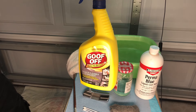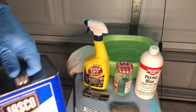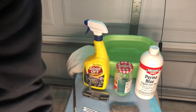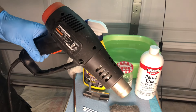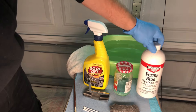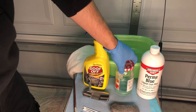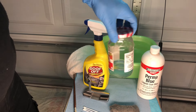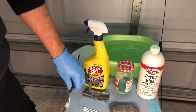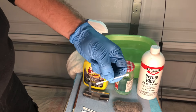All right, so you're going to need a degreaser to take off any oils, fingerprints, etc. Another thing that will help is some acetone. You're going to need a heat gun — I like to heat up the part so the gunmetal will actually burn into the surface. You'll also need Birchwood Casey Perma Blue gunmetal liquid, a little jar to keep the liquid separated so you don't contaminate the whole bottle, a firm paintbrush, wire wool, and some Q-tips to get into any tight corners.